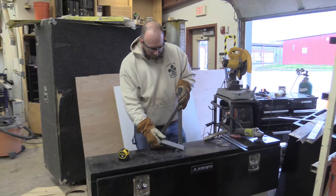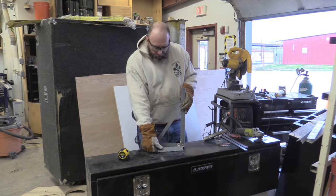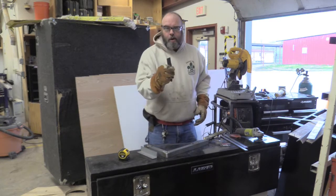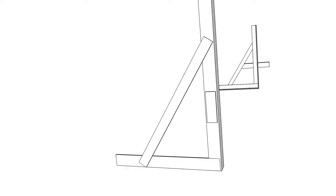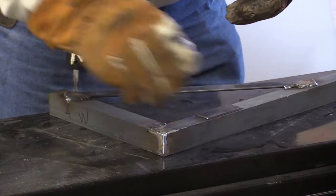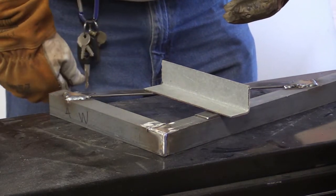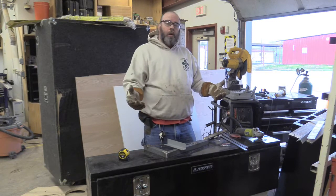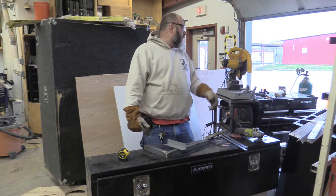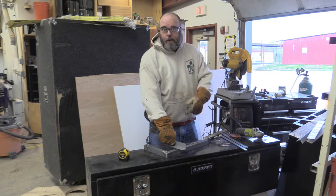The situation we're running into is our strap is now an eighth of an inch further out. Since we have some scrap strap left over, I'm just picking a three-inch piece and welding it there so that when this goes on, everything sits straight and square and prevents the L-brackets from angling out or not fitting properly. After that we'll need to paint, and since the rain doesn't seem to be letting up, we'll come back when it's dry.